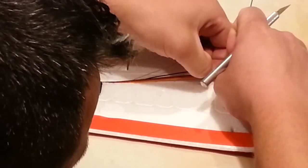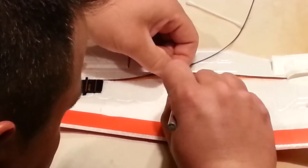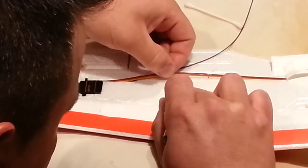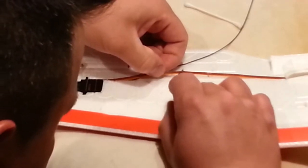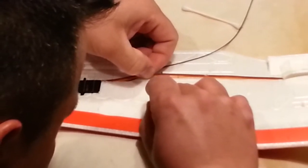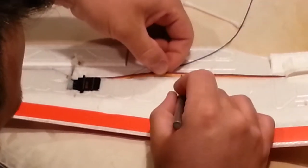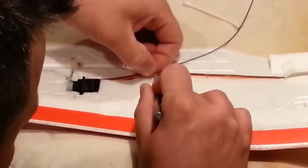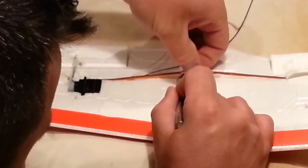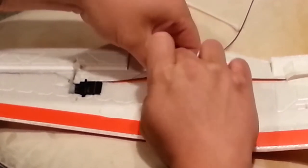Kind of the same as I did before - I'm just trying to separate that copper. It's actually quite a bit harder than it looks on this step; I'm sure you guys can probably appreciate that if you've done it before. Same thing here except I'm going to separate the power lead from the signal lead. I'm just leaving myself ample room between where these two connection points will be to mitigate the risk of short circuit. Once you have those wires separated you don't have to use the knife - that's a little bit safer - but the knife does make it a little easier.